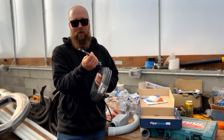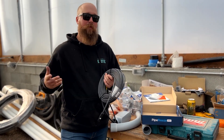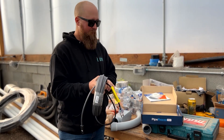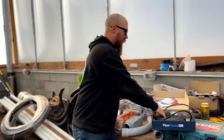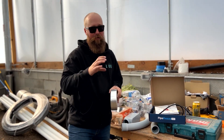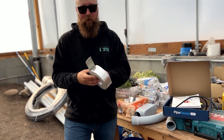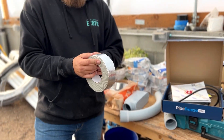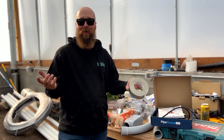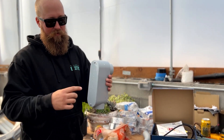Some heat cables just run less or not as hot in the summertime, but I don't want something wasting electricity that I'll forget to unplug. So I leave it plugged in year-round — in the summertime it won't run at all, and in the winter the thermostat controls how hot it needs to get. When it's really cold it'll run hotter, when it's not so cold it'll run a little bit, and when it's warm it won't run at all — saves electricity. This is going to be taped to the pipe using foil tape along the bottom side of the black poly. Then we were going to use foam insulating sleeves, but they wouldn't fit inside the two-inch PVC, so instead we're using this insulation wrap that spirals around the whole pipe for extra insulation. Then the whole thing is sleeved inside the two-inch PVC. To get it onto the house, we're using this electrical conduit pull-through box — we'll drill a hole in the house, mount this against the wall, run a fitting into the house, and connect to the copper line for our supply.